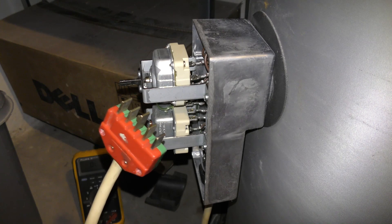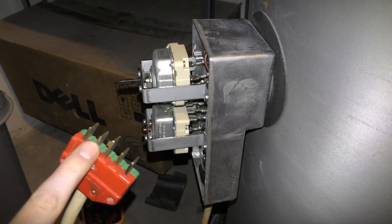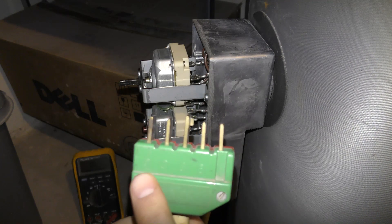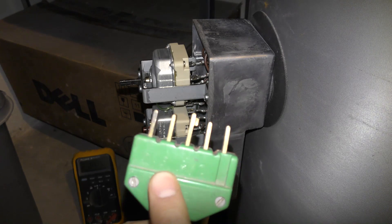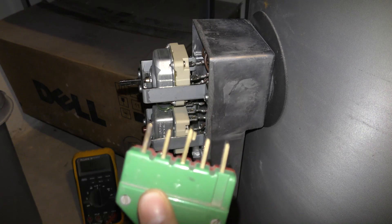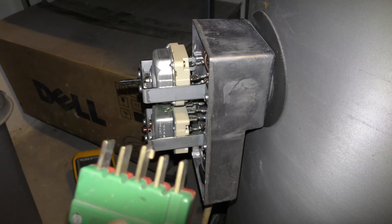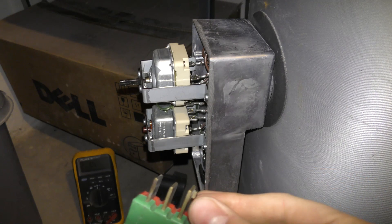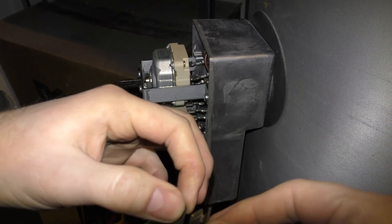Luckily, those wires are connected to this one. I just need to connect one to the plus of my solar system and the others to the phases. You can see here which wires are what: there's the zero — that's the blue one that was not connected. There's an F for phase — spelled differently here, you call it PH, we started with an F. There's a ground connection, I don't really need that. And there are two more phases over here. I need to connect these two phases together and this phase, and I will have my solar set up.